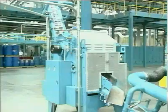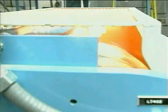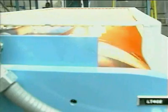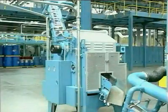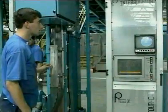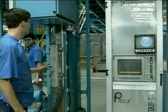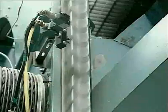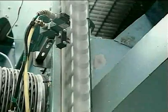From the spin flanger, the cans are passed through the light tester to check for split flanges or pinholes. Cans pass through a low-intensity light source. Any can emitting light is rejected. There's further online quality control with a vision inspection system. This is an internal inspection of the can using a video camera coupled to a computer capable of recognizing defects on the inside of the can. Any can with a visual defect is automatically rejected.